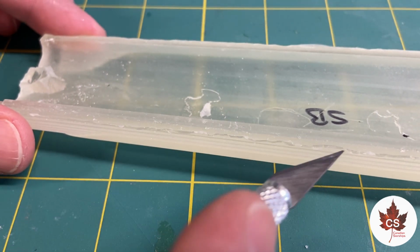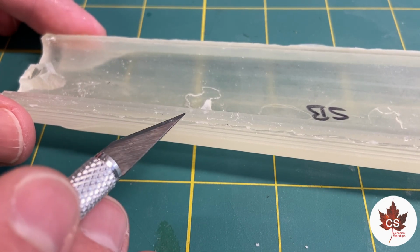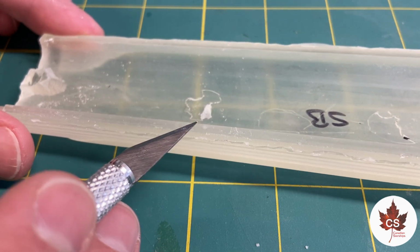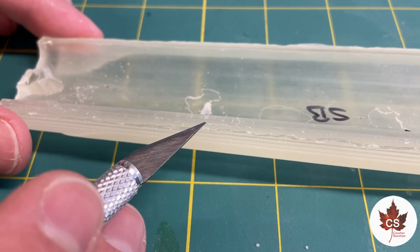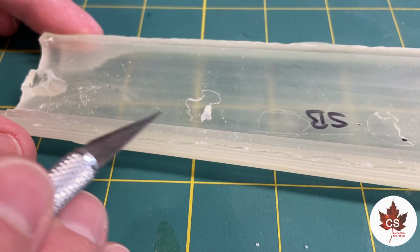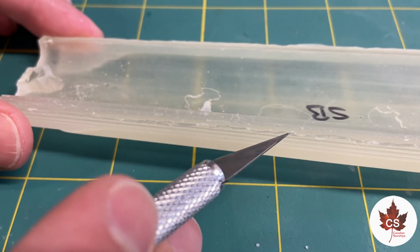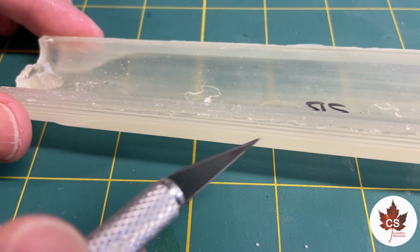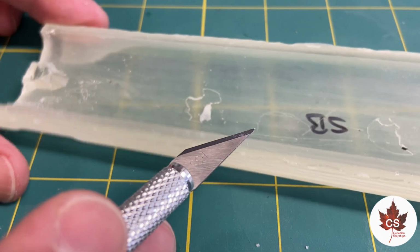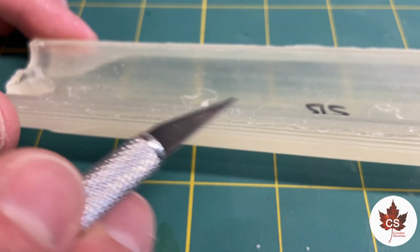Now, in order to clear all this junk that doesn't belong here off the part, I'm gonna have to sacrifice the key as well. So I'm gonna have to just be very careful how I put the two halves together, because there's no other way for me to deal with this. This is just a problem that was created during the casting process of the parts. And both halves on both nacelles are exactly the same way.